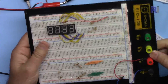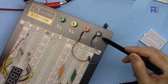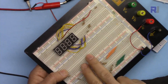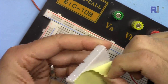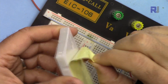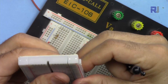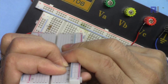You can attach these breadboards together and make a larger breadboard as much as you want. The breadboard is also sold with three breadboards attached together on a piece of metal, with some terminals so you can connect your power supply. I've connected positive and negative here using 4mm banana connectors. At the bottom of the breadboard there is an adhesive — double-sided tape with glue — in case you want to attach it to something permanently. You can also remove the power rail strip if you don't need it.